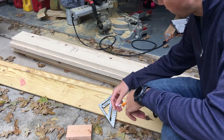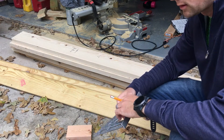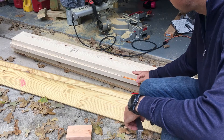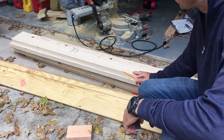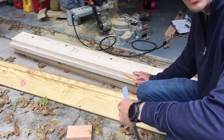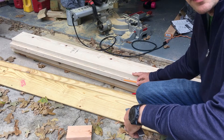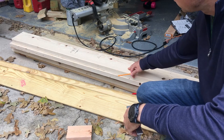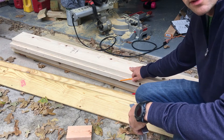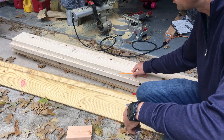Today we're still working on the playhouse, talking about how to use a Swanson square to get a 22.5 degree line along this two by six so we can use it for one of the rafters. With the playhouse we're not necessarily tied to the plans as much as we would be with a house, so we want to maximize the use of our wood. We've got a two by six by eight, and the plans may call for a nine inch overhang — in this case we just want to use the maximum we can to get close to that.